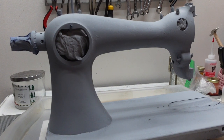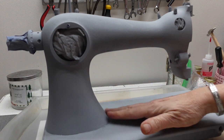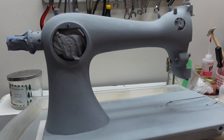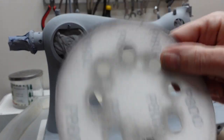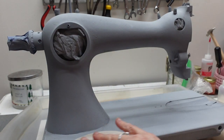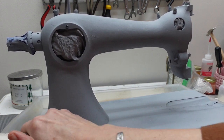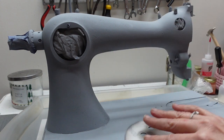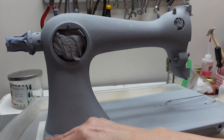It's been several hours since I painted her, so now it's time to bring her inside and do some sanding — just to smooth everything out. This first filler coat is a filler so it'll go in the pores, but it's also a little bit rough. I have two different sandpapers: P180 and then a super fine P800. I'm going to work with the P180 first, lightly sanding it — you can feel the surface becomes a lot smoother just after a light sand. Once it's all nice and smooth, I'll come back with the P800 to give it a nice polish. That makes it super nice, and then it'll be ready to get its color.